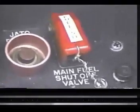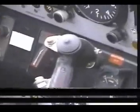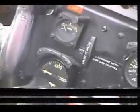Throttle — the blue light indicating fuel is your main fuselage pump; it'll be on at all times. Right there is your electric fuel shutoff in case of a fire, up on the stick. You've got your automatic relight in the thumb position, and on top the Chinese hat controls your forward and aft elevator and your left and right aileron.